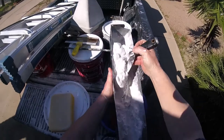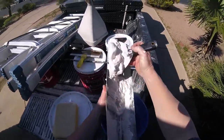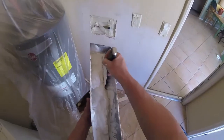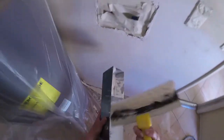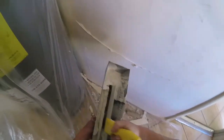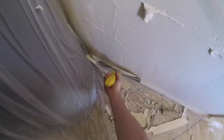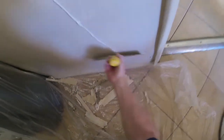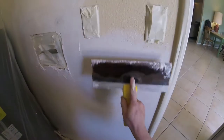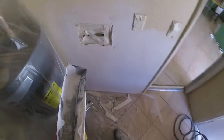Now I'm ready for a second coat. The second coat is going to be a little thinner than the first coat. I'm using five-minute mud so I'm just going to mix up just over a quarter of a pan — a little thinner than my first coat. I like to mix pan by pan whenever I do these patch jobs. Make sure it's mixed thoroughly — nice and creamy, no lumps. I'm coating it real tight with a 12-inch knife, going past my first coat work. Basically doing a skim coat — not coating heavy; the first coat already did the main job.